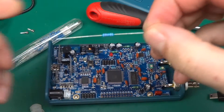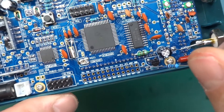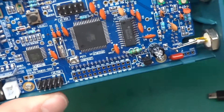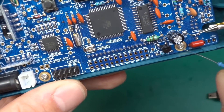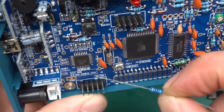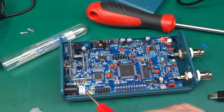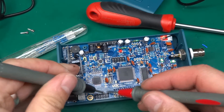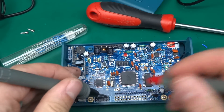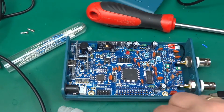Here we have a 1k resistor as needed. We need to connect the PF6 point, which is this one here — the third one from the right on the JS or PD5 connector. I've got a ground pad over here or this connector with two points marked as ground. I'll buzz it out to make sure those actually are ground — yes, those are connected — and then buzz it to the screw. That's ground to the negative, so yes, that's all ground.